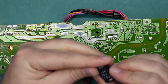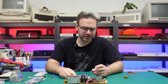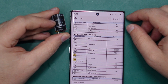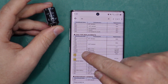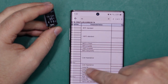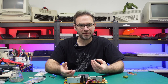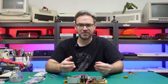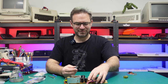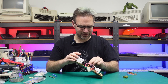Now to find a replacement cap - 470/35. I don't have anything to replace it with. I couldn't find a data sheet for the Chemicon SXA series. I did find SXC and SXE listed and the characteristics of those are both low impedance, so I'm assuming this is going to be a low impedance capacitor and I have to replace it with something low impedance. At the moment I don't have one on hand, so we're just going to stick this back in and hope it's still somewhat good. Add that to the list of capacitors I need to get.